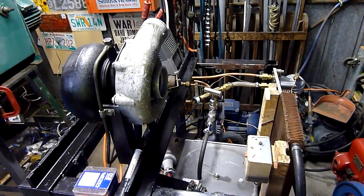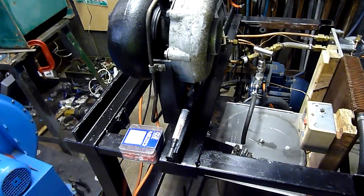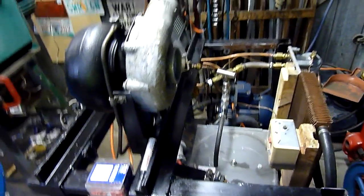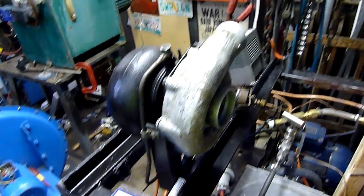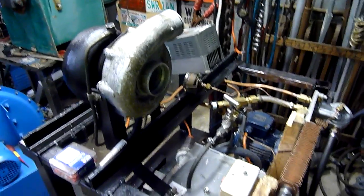I've had oil pressure up to 50 psi and it sits there idling away quite nicely. I'm thinking the other option is to take that motor off and put a DC motor on there and use a MOSFET-based DC speed controller — I'll use a Curtis DC controller. Or I try and find one at work and borrow a Delta brand VFD for a weekend or something. Not as bad as Allen Bradley or any of the big ones, but still a few hundred dollars worth. I'll see if I can borrow one from work if I can find one big enough. I found one today but that was only 0.4 kilowatts — even though this thing isn't pulling many amps, I don't want to risk blowing it up.